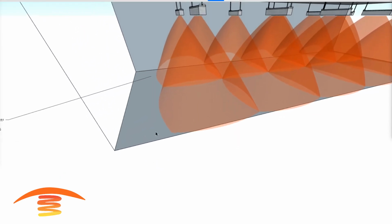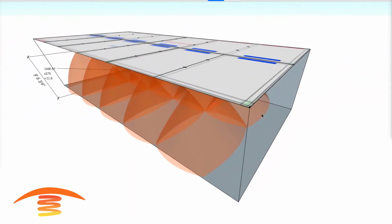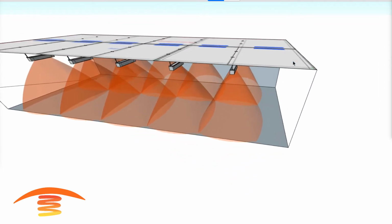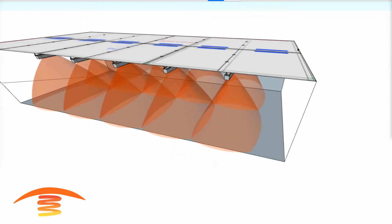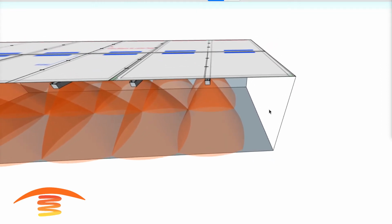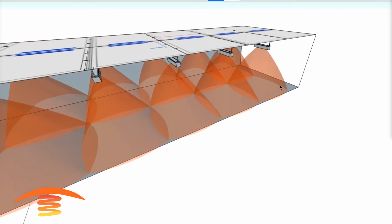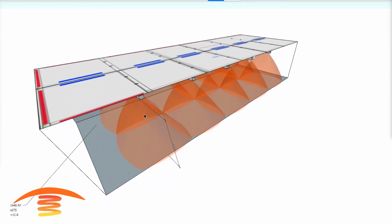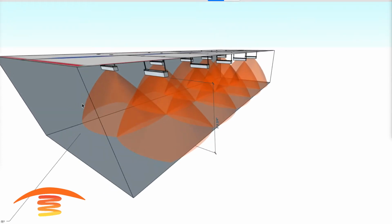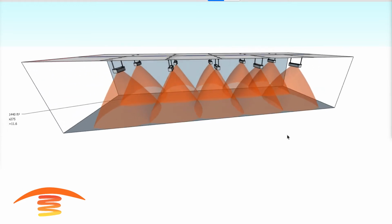I'd say this is approximately 4 or 5 feet on either side, and there are going to be drop downs and we can't mount a heater on either edge. If we could, then we would, but you'd have to bring the heater out further, and it's possible to do, but I believe there's going to be some isinglass on one side or the other. You don't want this direct heat ray to heat up a portion of that isinglass, and it'll melt it pretty rapidly, I think. So anyways, there you go.